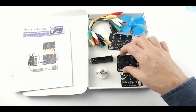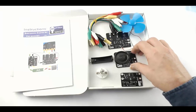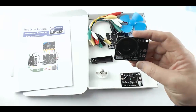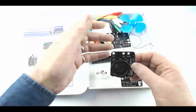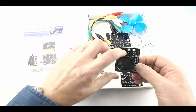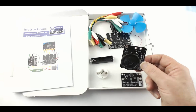The kit also includes these boards, so let's have a look at them in turn. This is the speaker for micro:bit — it's an amplified speaker. You connect ground and three volts to provide it with power from the micro:bit, and then the input signal to the little amplifier and speaker comes from an output of the micro:bit.